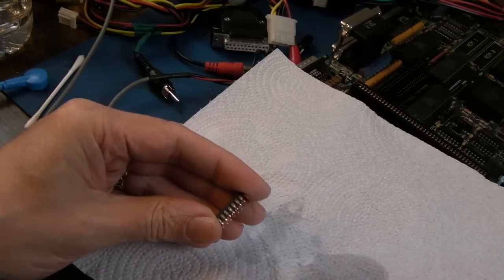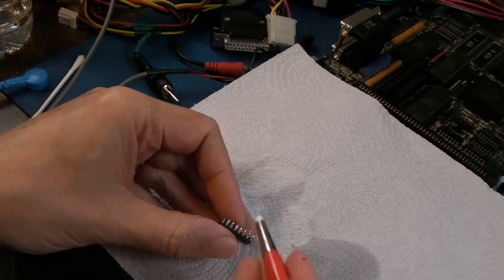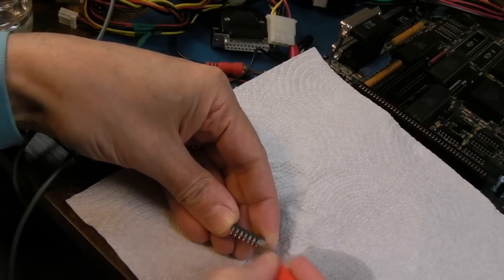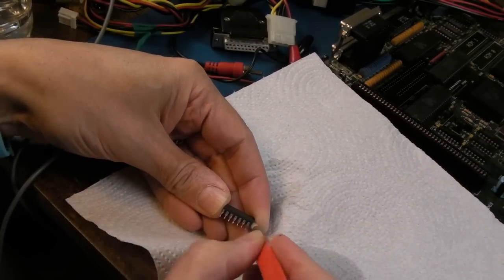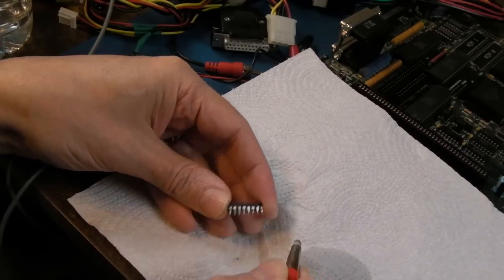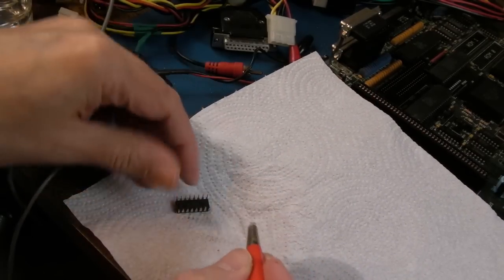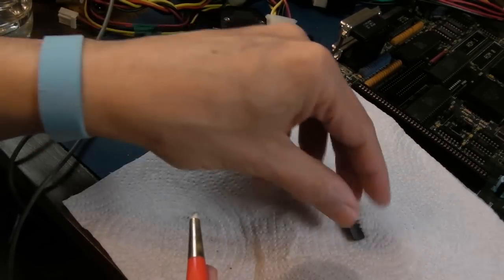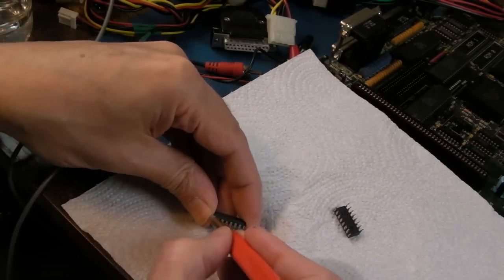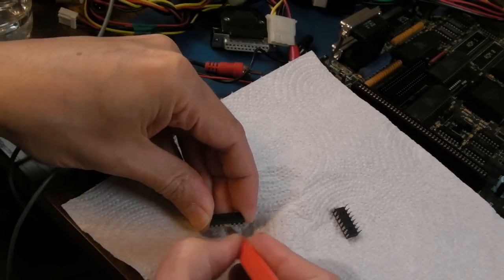The next thing to do is to clean up these crusty RAM chips. So I would imagine these are not going to make a particularly good connection, actually. Anyway, it's a multi-step approach, as I say. We'll do the stuff with the desolder braid on that in a minute, then we'll clean with some IPA and a toothbrush, then use the pliers to straighten the legs. But we'll do the same thing to both of these.